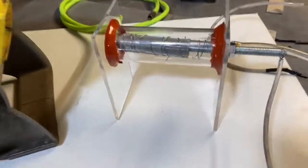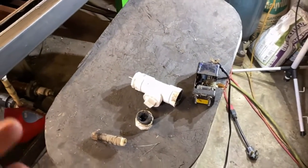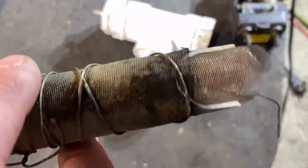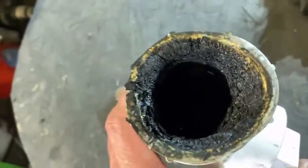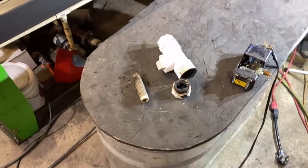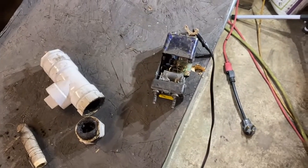So don't build your own stuff and then leave. This is the ozone generator I built. The reason I built it is because this one caught on fire and I think I know why that happened. Here was the electrode that was in there. It broke from me dropping it, but a fire started inside of the ozone generator. Because I was using 95% oxygen, it was a pretty dramatic incident. Subsequent to that the transformer fried itself, which is why it's sitting here all cut up right now.